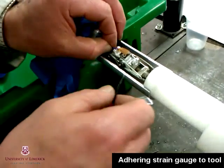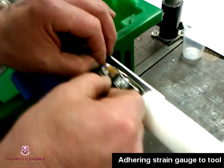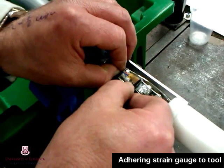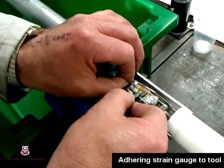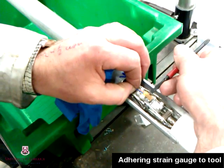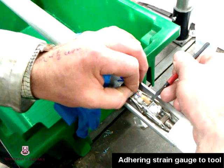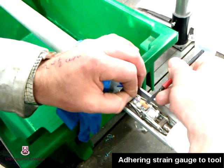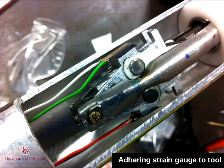We were surprised by the durability of the strain gauges as we applied them to the installation tool. They were quite flexible when we tried to place them down and bond them to the double-sided sticky tape. Another change since this video was taken is that the two front kickers on the tool have been cut off, as they obstructed the path for the wires and would sometimes get caught on the wall of the pipe as we expanded the arms.